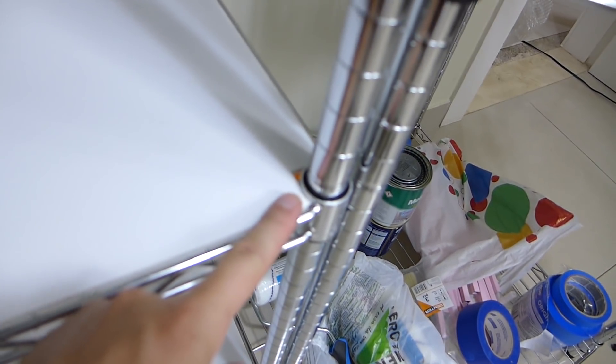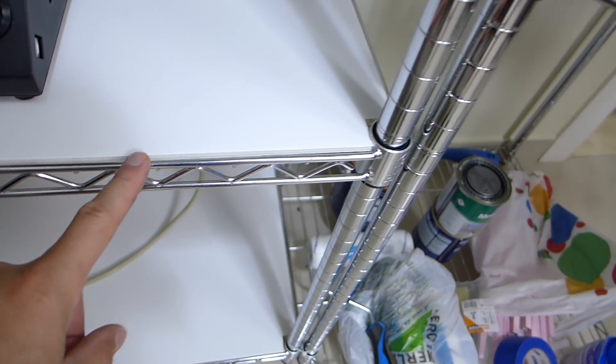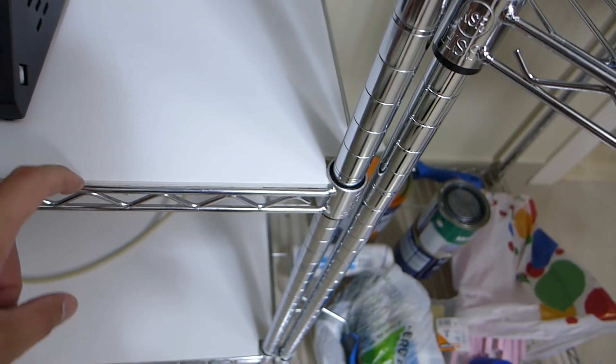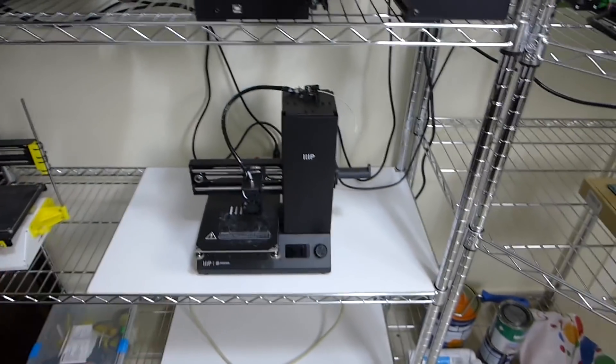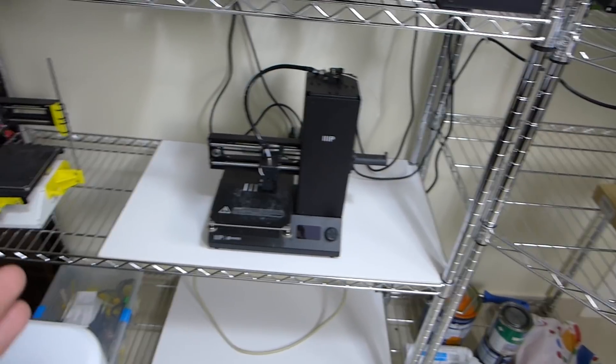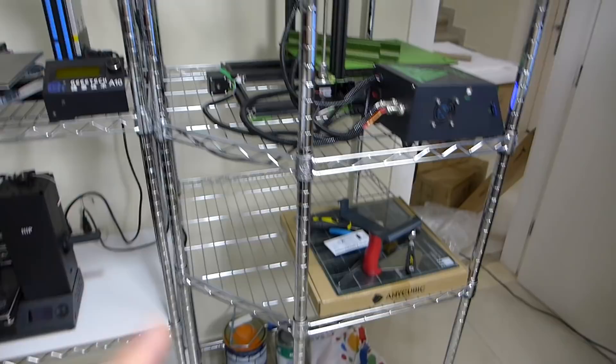All I had to do is cut out a one-inch notch in the corners — it goes all the way over. These are 17 and nine-sixteenths wide, which gives just a little bit of lip here. One down there is a little bit tighter, but that makes it nice to look at. So I'm going to do one — these are four sheets right here, the full 30 inches. I'm going to do these shelves right here first, and then the corner. With 10 sheets, that's all I'm really going to have space for.